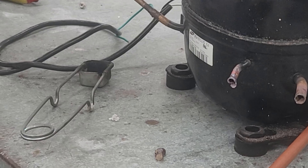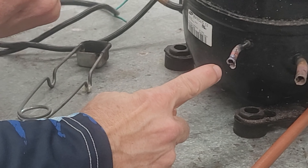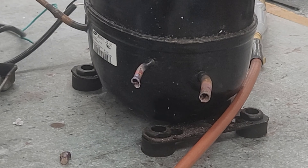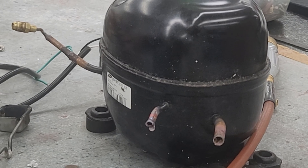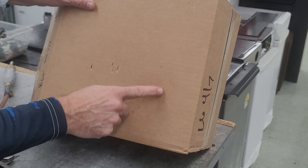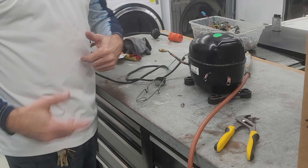Any questions? — That little second you plugged it in created enough pressure? — Yeah. Remember, look at the size of this pipe versus that pipe. Even for three seconds, the amount of air inside this chamber when it pumps to the high side goes into a super small tube, so it's already compressing it. I didn't intentionally do it — I just plugged it in to check if the relay would work, and it happened to build up enough pressure. Once I heated it, you can see a little bit of oil that shot out and got on the cardboard.